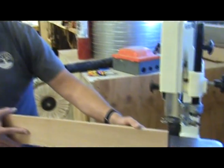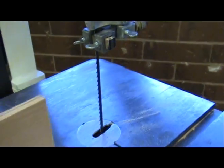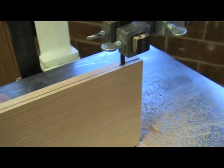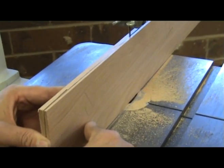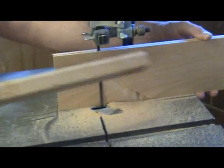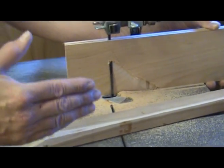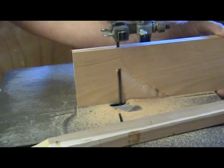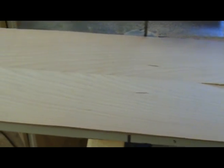I've got it positioned with between a half inch and an inch of clearance, which helps me guide the cut — but we'll lower the guard just a little for safety. I stopped to grab a push stick mid-cut, and as soon as I stopped and restarted the cut, I changed everything. The only kind of good cut with a bandsaw is a consistent feed speed. As soon as I stopped, I messed it up — I really should have had a push stick there waiting. It's not what a $250 blade gets you, but it's a pretty good cut. You'll get better the more you do it, so don't do it the first time with your piece of rosewood.